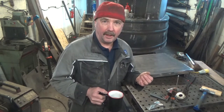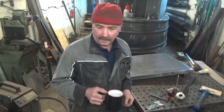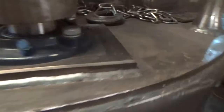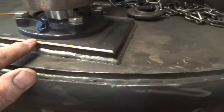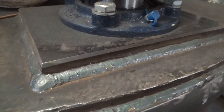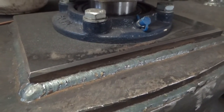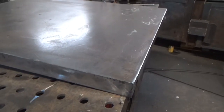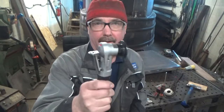All this does is chamfer - it uses one of those disposable tools that you put in a lathe for cutting steel. You can turn them around - four sides on them. Just have a look at what it does. Jack put some detailing on this the other day - see this chamfering around the edge? Puts a lovely little chamfer, perfect all the way around. You can put it at its maximum cut, or you can have it less than that, because it's got a little indexing head on it so you can wind it up and down. So I thought, instead of just having a sharp arris on here, we'll detail it with that. And there it is - it's a little air tool.